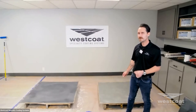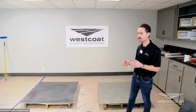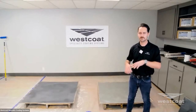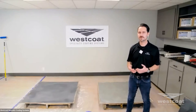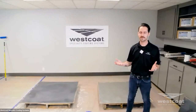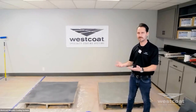We would prime with our EC12. In the metallic epoxy, specifically the Liquid Dazzle, you want to be conscientious of what primer you choose. For example, we're going to be showing the EC38 in graphite, so we've gone ahead and primed in a complementary color. If you had a slab that was really unlevel or had a lot of slope, you might need to consider preparing that slab and pouring a self-leveling topping — utilizing our TC26 or TC27 material to help plane out and even out that floor substrate.